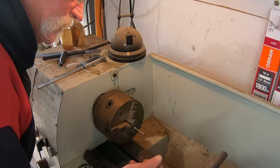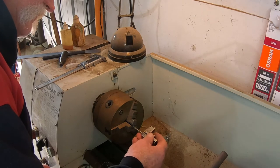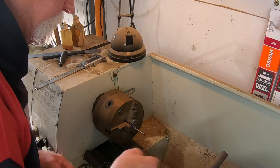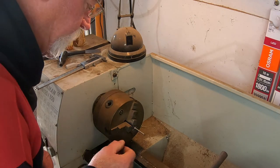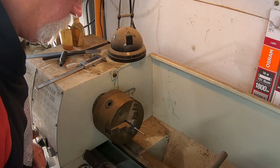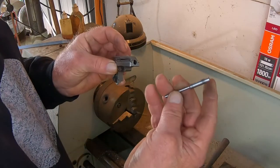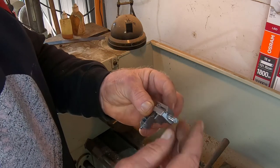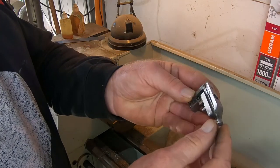There we have it. I've machined that down to an eighth of an inch, and the firing pin goes through there — it's a quite nice fit. Now I've got a bit of a tapered machine on this shoulder where it sits inside this part here. I'll probably freehand that and touch it up with a file. Well, I've taken it out of the lathe and cleaned that up a little bit with the file while it was in the lathe. You pop that in there — you can see that the pin itself goes right through. We'll trim that up later after I've done the taper and worked out the correct length.